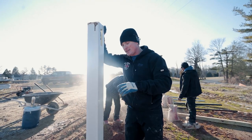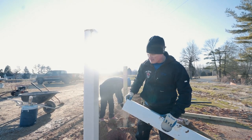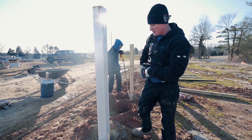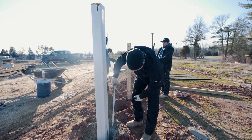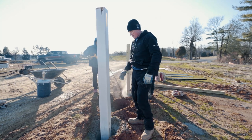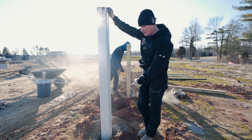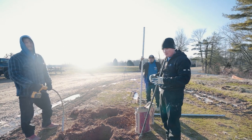This post is a five inch square post but has a keyhole at the bottom. It's four inches diameter. We have 160 pounds of concrete in this hole. It's an 11 inch diameter hole, 32 inches deep. You can see 160 pounds of concrete only filled the hole up to seven inches from the ground. So when I hear guys telling me one bag - 60 pounds - on a hole that's 32 inches deep, I don't see how that's possible. There's two bags right there. Round posts don't compact very well the way we did those.